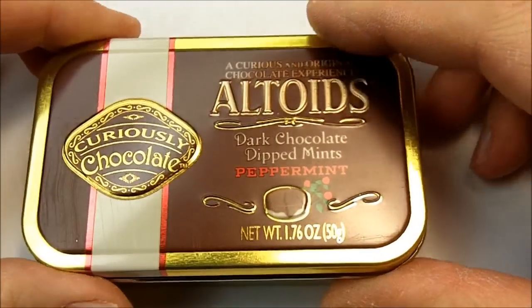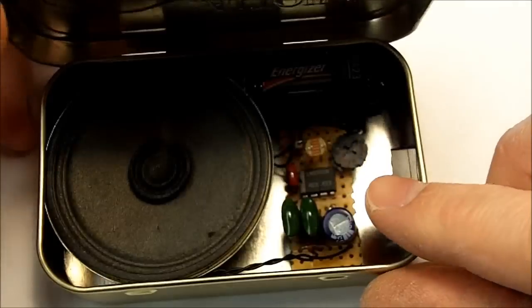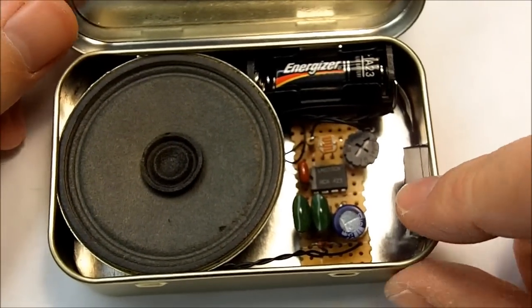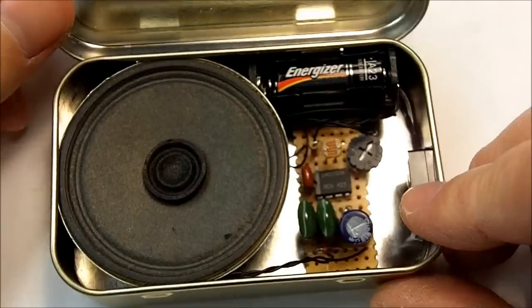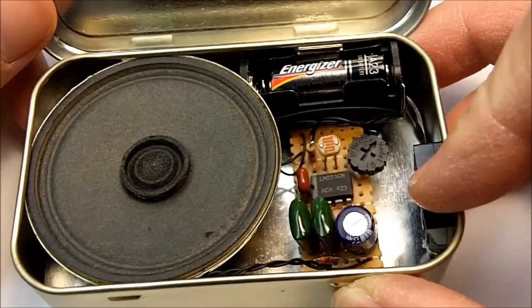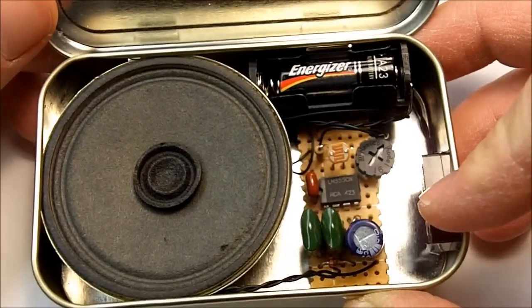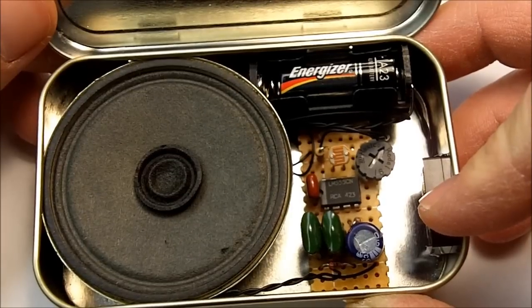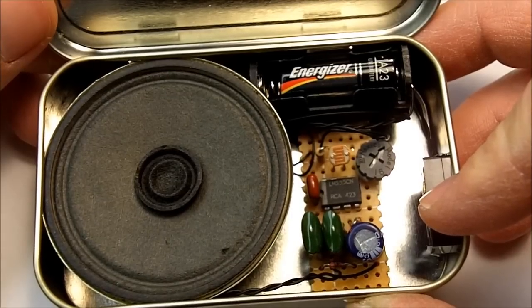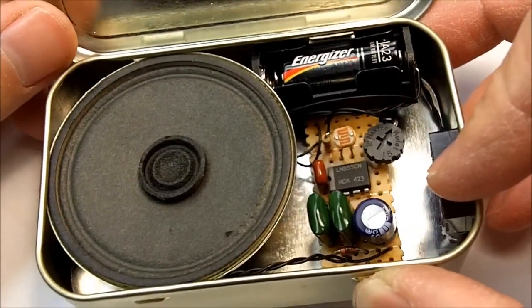I got the same kind of little micro switch to keep it completely off. Essentially it's the same thing, an astable circuit. There just happens to be a photo resistor in there, and there's a little bit of a clever feedback path to really give it more dynamic range — low all the way to high. And there's a little trim pot in there to adjust that.